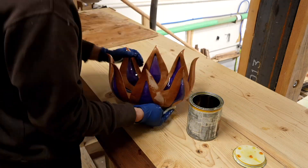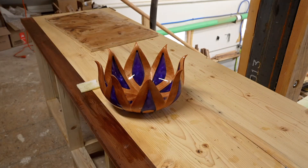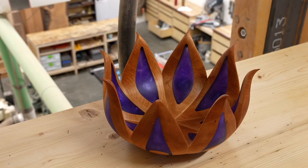Because of the epoxy seeping issue, I decided to use a thinner finish to let it soak in and hopefully hide a lot of that epoxy staining. So I used Osmo Super Thin to have it soak into the wood more than regular Osmo. After that dried, I put on a second coat using Osmo Top Oil to make it a little more food safe. So now let's take a look at how the project turned out.